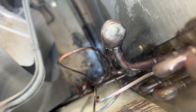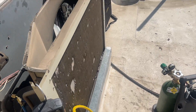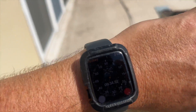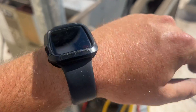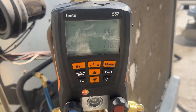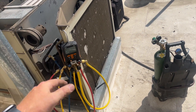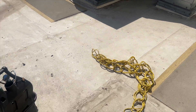That looks like we got it. We're going to put some more nitrogen in and see if it holds. We've got it under pressure — so far so good. It's been about nine and a half minutes and we're still at 116.8 psi; we started at 116.9, so not too worried about losing 0.1. I'm going to go find some electricity and get our vacuum started.